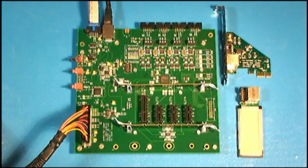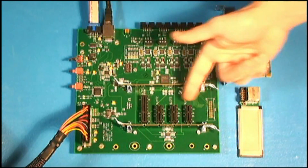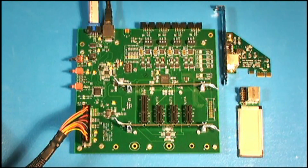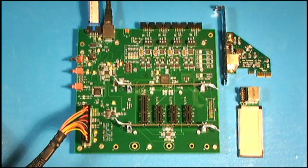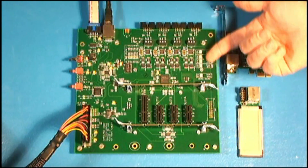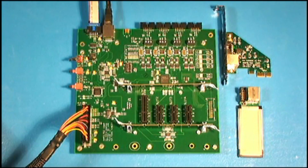Let me show you the PCI Express test backplane a little bit closer. This backplane has four slots for plug-in test boards — one with four PCI Express lanes and three with one. Each slot has a dedicated power controller for overcurrent and overvoltage protection, with visual power status indicators. Four separate JTAG connectors give you per-slot access to JTAG PCI signals. The backplane is powered by a standard ATX power supply and connected to the host computer via two seven-foot-long cables.